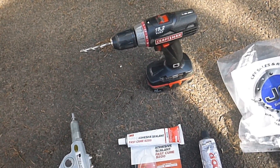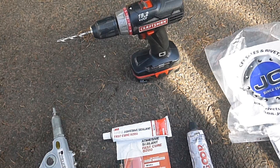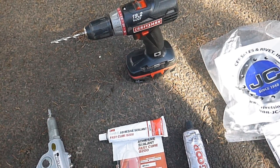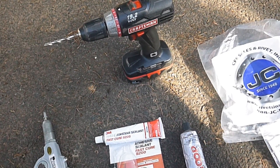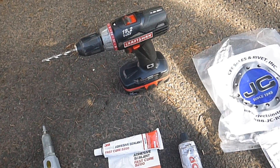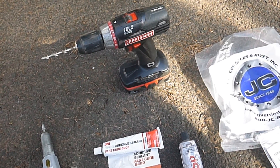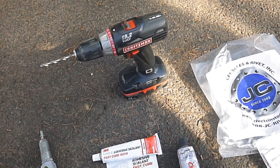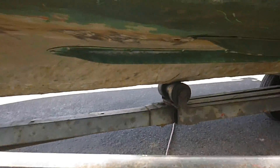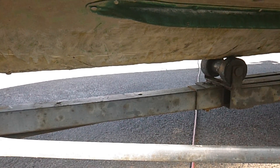Now if your holes are not perfectly round, you're going to need to drill them out for the rivet — you want them perfectly round and the smallest hole possible. On this job it's pretty easy: they had quarter-inch bolts so I got quarter-inch rivets and that's a quarter-inch drill bit. I haven't actually had to drill any out yet because the holes have been pretty round and the rivets go right in. I did use the drill bit itself to help align a couple of holes, but that's it.